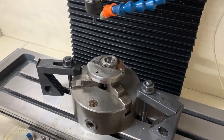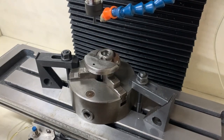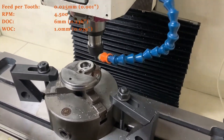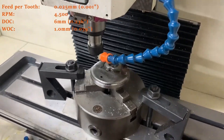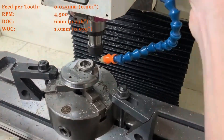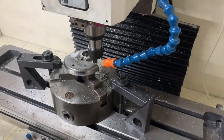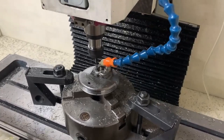Now let's talk about outsourcing during manufacture. In a perfect world you could do everything yourself, but sometimes it's not financially viable. For example, when I made the crank pin for the V-twin I outsourced the heat treatment and cylindrical grinding — I didn't own a cylindrical grinder, and it only cost $80. For the V4 project, someone has reached out to help me machine all the custom gears I'll need. If I were doing it alone, I'd machine the gear blanks myself but outsource the actual tooth cutting and hardening — that's just a better job outsourced.